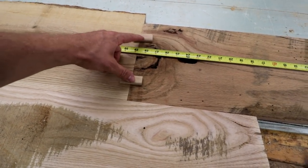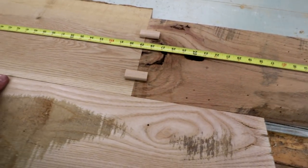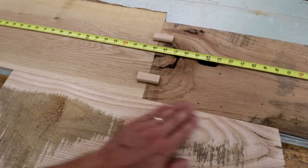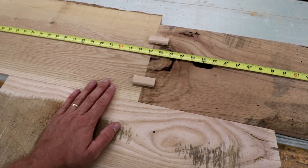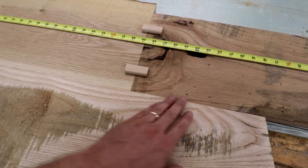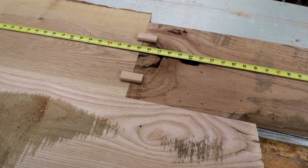These act to keep everything aligned, plus a little bit of shear strength in that direction. Then, when you bridge that gap, all of a sudden you've got this glue joint and this becomes extremely strong. I've done this on a table and I walked around on top of a table and bounced up and down and nothing cracked or anything. The strength of wood glue on a proper joint is incredibly strong.